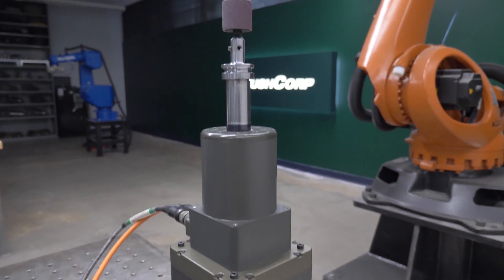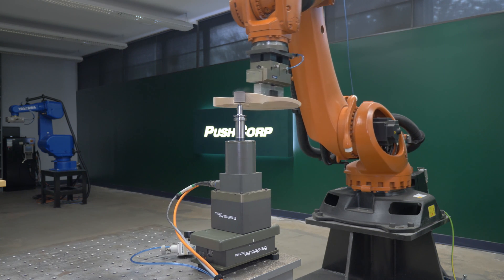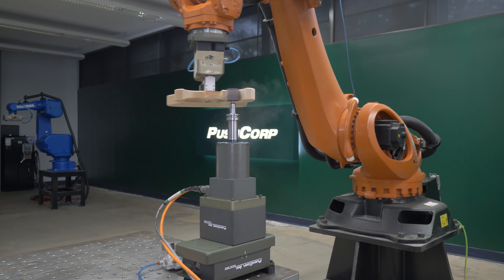Step 1 was to sand the concave flats near the neck with the expander wheel and 3M 341D spiral band. You can see a spot we could not reach with the diameter of band used. The end user will size down the diameter of the expander wheel and be able to reach all the way into the apex of the curves.